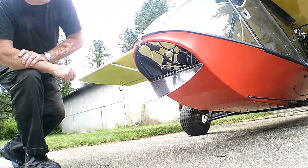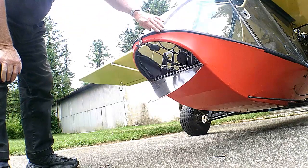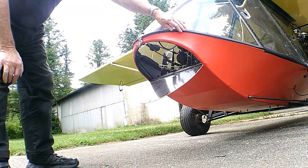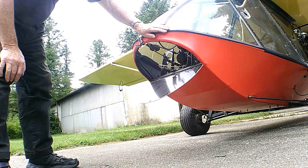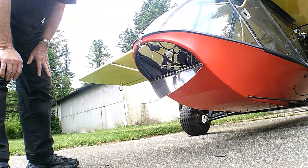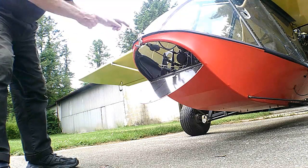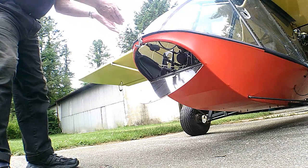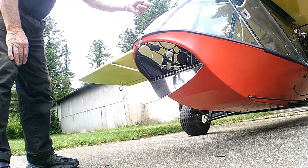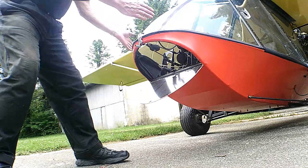The way that I made this curve around here was with what they call a tubing roll. It's like sheet metal rolls, except it has a radius cut in the rollers for the diameter of tubing you want to bend. I'd mark a spot in the middle and keep rolling it back and forth until I got the radius that I wanted, and I could measure across with a tape measure or ruler when I had the width that I wanted.